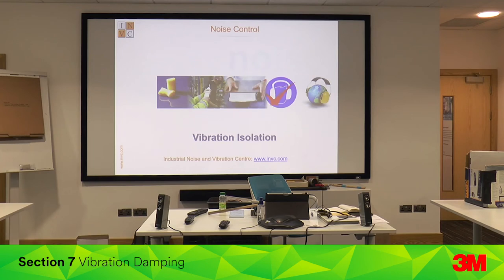We did tests on a linear feeder — a big hopper vibrated with plastic hypodermic syringe bodies. We tested the feed rate at various vibration levels. The feed rate went up, levelled off, and then started to go down as they turned it up further. No one turns it down to make flow faster, because that seems obviously wrong. We found the optimal point and locked them all off at a set point so it couldn't be turned up any more. We also used laminated steel and had to adjust the geometry slightly to improve flow.